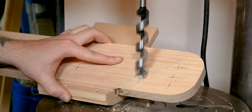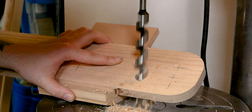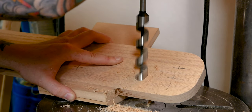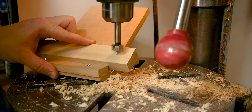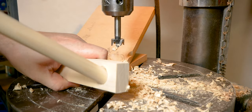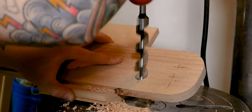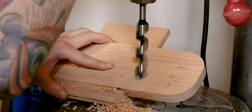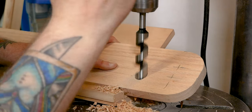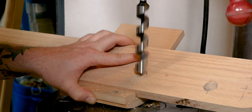After a lot of trial and error I found an auger bit to be the best tool for drilling the dowel holes, regardless of whether you're using a drill press or a quick drilling jig for a handheld drill. A forstner bit chatters around too much, a hole saw cuts a very loose joint, and finding a three-quarter inch standard bit can be difficult and expensive. Just go slow with the auger bit — like real slow — otherwise the pilot bit might grab the wood as it's supposed to and pull the workpiece, causing some problems.